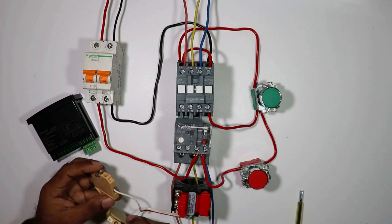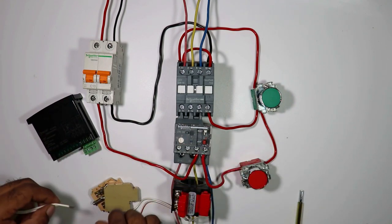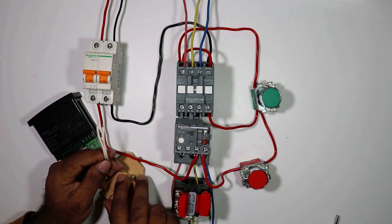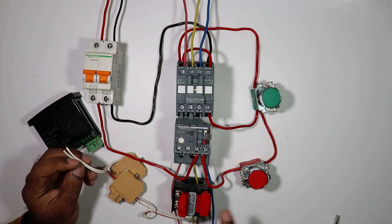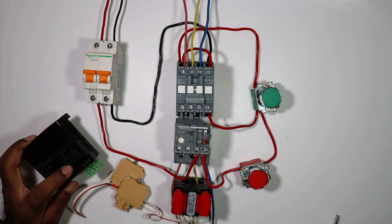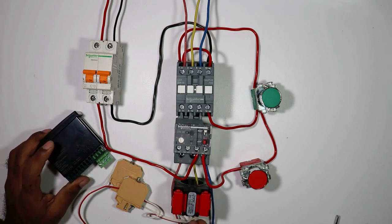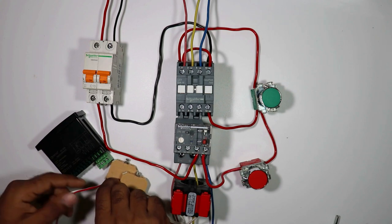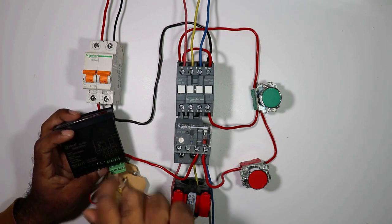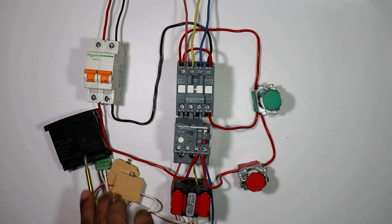With the TB we completed the connections of wire. Now wire from this TB will directly go to the ammeter. Take one end of a wire and connect with one TB, and take the second wire and connect one end with another TB. Now be careful here - you have to see this S1; it has to be connected with S1 terminal of the ammeter, and S2 connected with S2. In this ammeter, in place of S1, L is written and in place of S2, K is written. So the wire going from S1 - this red wire - will be connected with L (S1), and the second wire will be connected with K (S2).